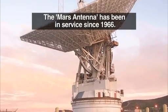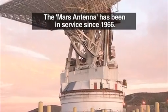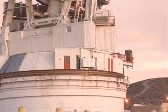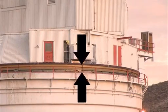There are several different things that were done for this antenna at this time. The biggest job was replacing the azimuth bearing. This whole antenna floats on a film of oil about 5 to 10 thousandths of an inch thick — about the thickness of a sheet of paper. We had to replace the entire assembly that allowed that to happen.